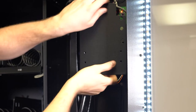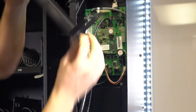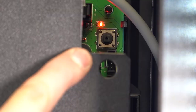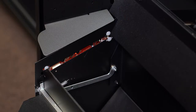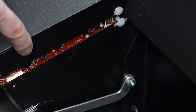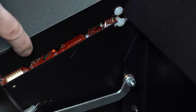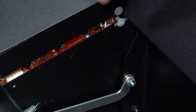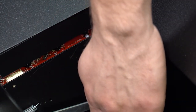To access the control board, lift the cover off. Below the red light is the service mode button. Down near the delivery bin is the iVend sensor system. Here's the infrared light emitter board that senses when a product passes into the delivery bin — the red light goes off when an item passes through.